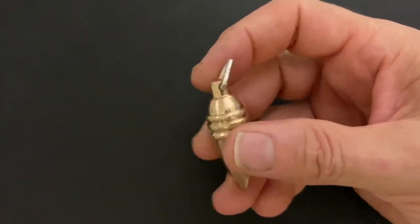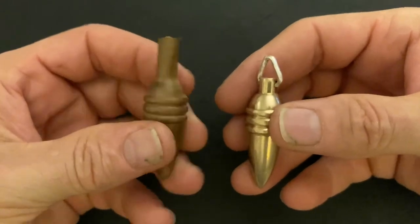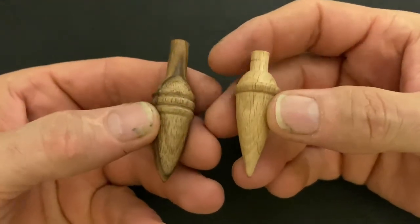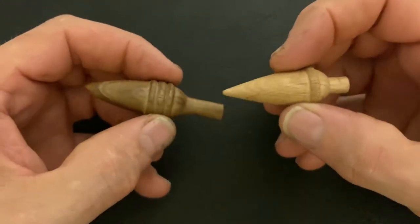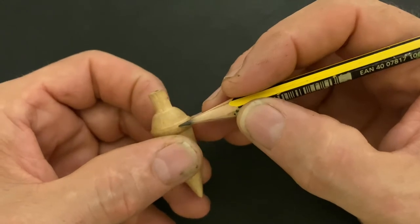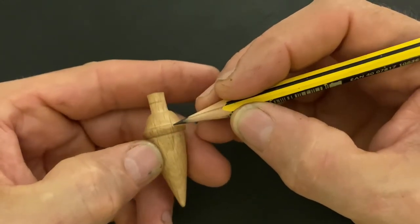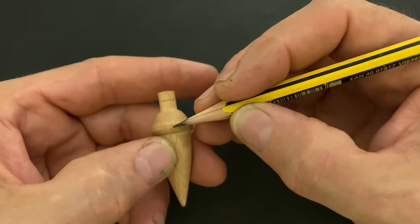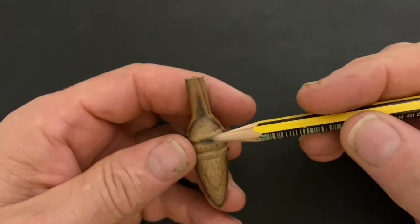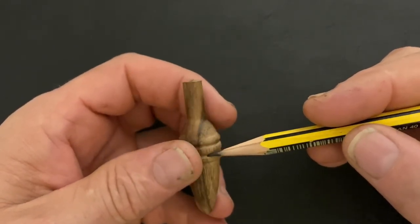Here's another example. I love casting pendulums and this is its pattern. Here's another that's very similar. Both could be cast with parting lines running their lengths. However, only this one can be pushed into the sand point first, so the parting line runs around the circumference of the pattern. If I tried the same orientation with the first pattern, the clay would stick in these grooves and prevent it from releasing from the mould neatly.